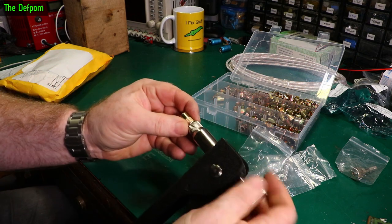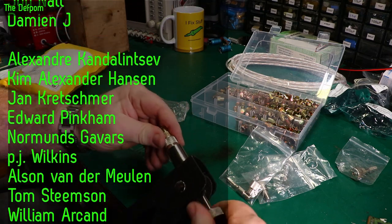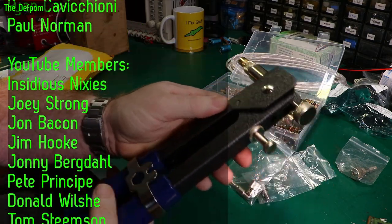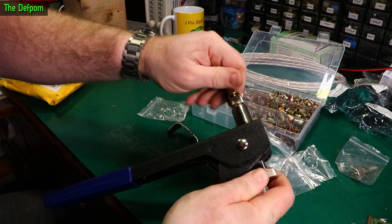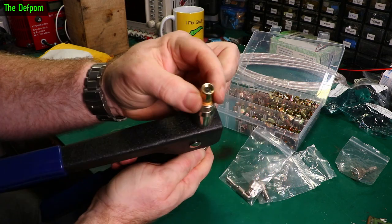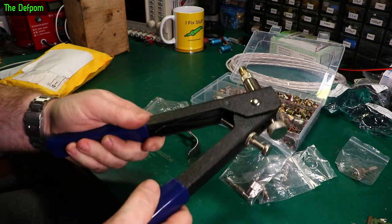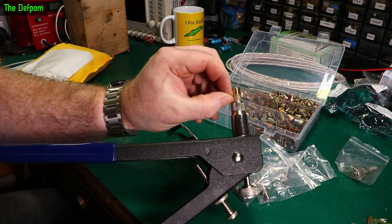It's also left-hand thread apparently. And there's a nut. What you actually want to do is screw this in with that onto the rivet nut. So that would be screwed in, and then you would basically pull the nut in with a riveter. Right now it is pulled in because I haven't released the clamp, so let's do this — that will allow it to come forward more. So now you can screw it on. All you've got to do is have a piece of sheet metal with a hole in it, see the studs right to the end there, just put this through the hole and rivet it — literally just crimp it with this.